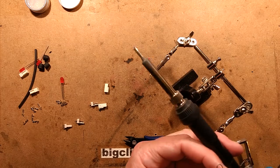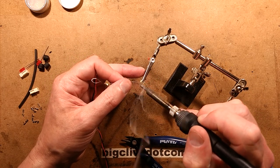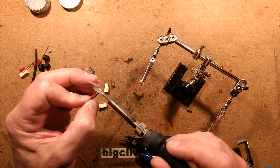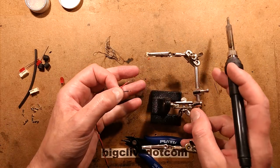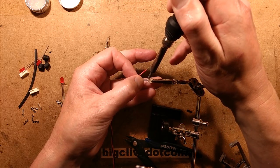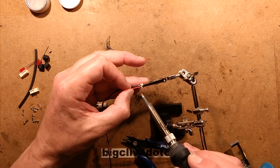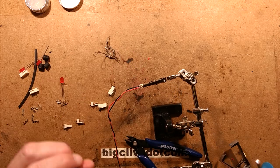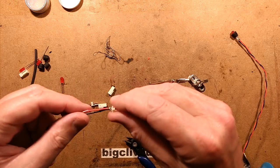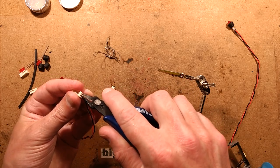I'll tin everything including the wires and flow solder onto the connector. I'll do the black first — onto the back — then the red. Just lay it on top and re-flow it briefly, because otherwise the pin can get soft and the plastic can move. Once the heat shrink is on, make sure there's no solder tail. That's the first LED strand made.